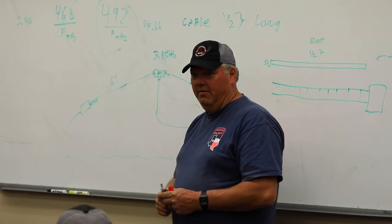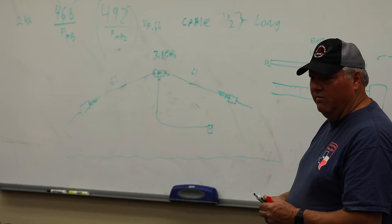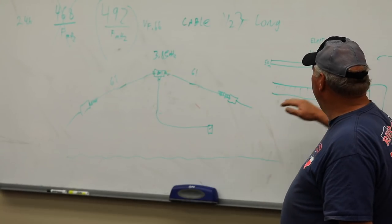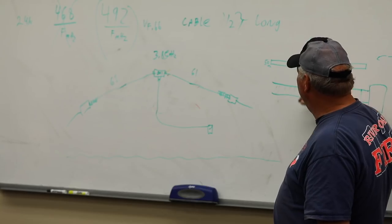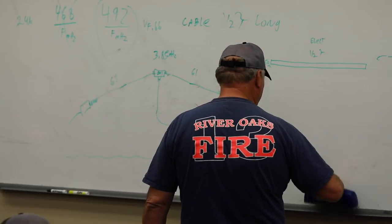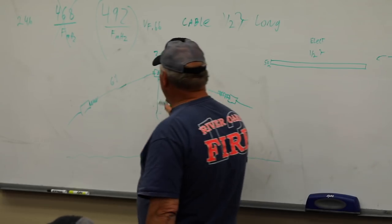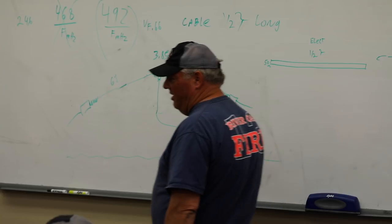So with the ladder line, you're replacing the ladder line with the coax. So would that be the 85 feet that you would figure out? Well, either one of these can be a half wavelength, either one of them can be used. But you know, Corey, we're gonna erase this. The reason we're gonna erase that is because we use coax 99% of the time. So we're coming in coax, so we figured out that coax needed to be about 84, 85 feet.